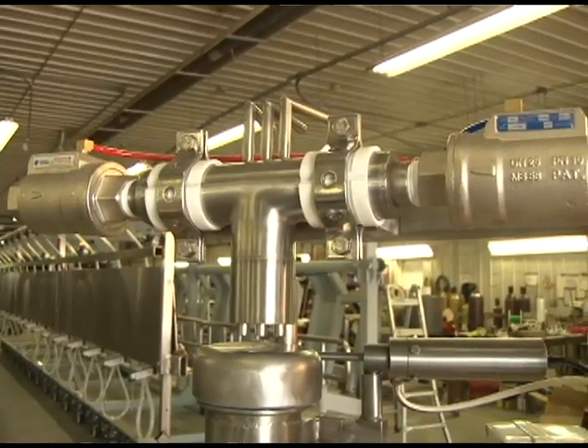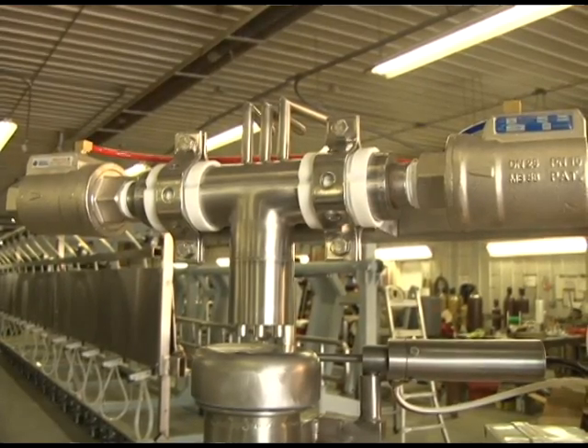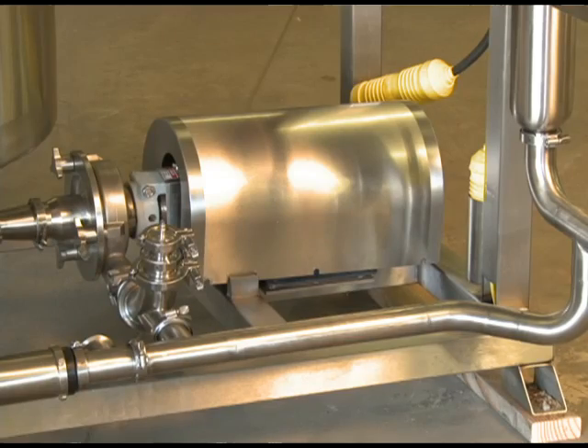The CIP Receiver Group is a controlled system — it's a closed system. The tank you see behind me, the receiver itself, is a rather large receiver for milking, but it's also the CIP tank for the wash up. The tank is closed. When you push the button to start the wash up, the input group opens. Hot and cold water comes in — only hot water during the detergent cycle. After a minute or two, the tank is filled with the amount of water you need. The system closes, seals up, the milk pump starts, and the vacuum pump starts at the same time. It's a pressure wash system, not vacuum wash — also known as a push-pull system.